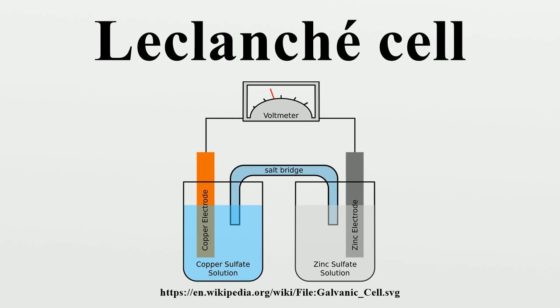The electromotive force produced by a Leclanché cell is 1.4 volts, with a resistance of several ohms where a porous pot is used. It saw extensive usage in telegraphy, signaling, electric bells, and similar applications where intermittent current was required and it was desirable that a battery should require little maintenance. The Leclanché battery was the forerunner of the modern zinc-carbon battery. The addition of zinc chloride to the electrolyte paste raised the EMF to 1.5 volts. Later developments dispensed with the ammonium chloride completely, giving a cell that could endure more sustained discharge without its internal resistance rising as quickly.